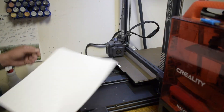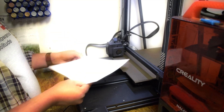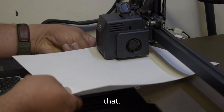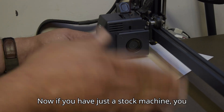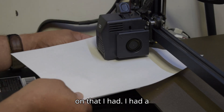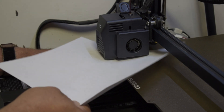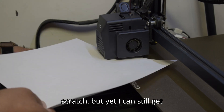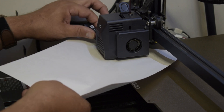Now we take the best thing in our toolbox — a regular white piece of paper. As you can see, it's moving over that little wheel underneath. We're going to turn that clockwise, letting the bed raise up. If you have a stock machine, you have the wheel and springs; I have wheels with silicone mounts instead. The paper should still move freely but give just a little bit of tug and scratch — just enough resistance that I can still get underneath it.